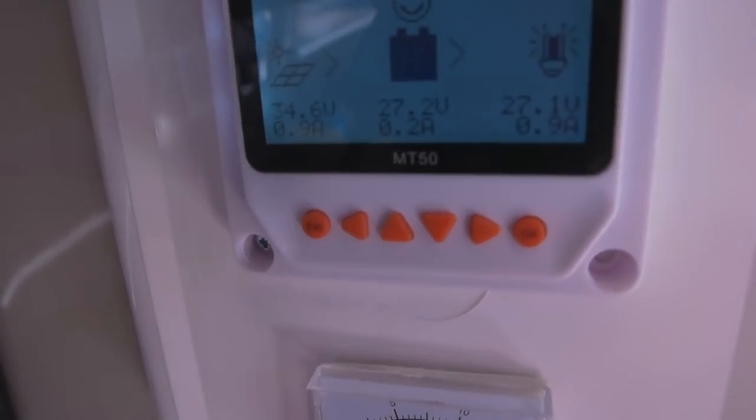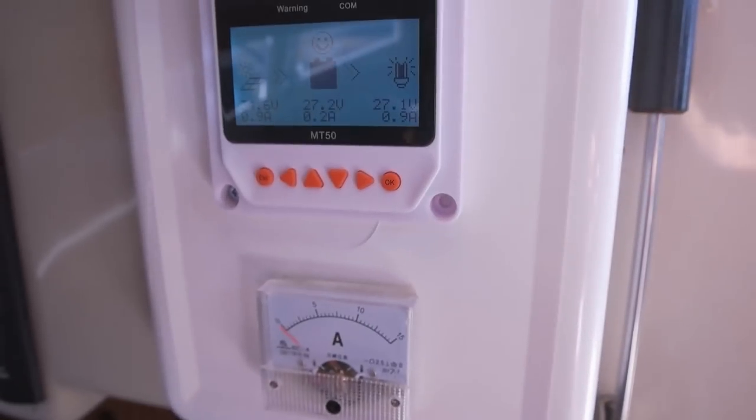Hola. It's now been about 30 minutes, 34. My guess is that the temperature inside is only like 20 or something, because that's the minimum speed and minimum power of the compressor. That is only 1 amp. Can you see it? That's my consumption, 0.9, 1.1 at some point. I don't have any other stuff running here, so the consumption is all about that.